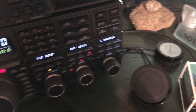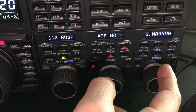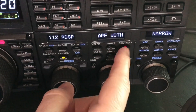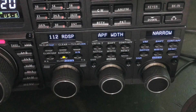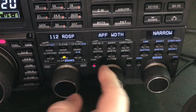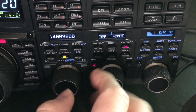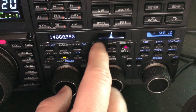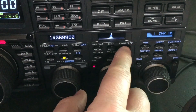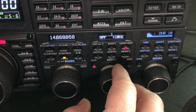The audio peak filter has this option called super narrow. Let me put it on normal narrow and you can hear the difference. I am using digital noise reduction set at 15. I have the APF set at negative 20 because he was reading just a little bit off frequency — 20 hertz. But with the APF it's so tight, especially when you've got it set at super narrow, that you can move it in 10 hertz increments and it'll make a difference. It'll pull them out a little bit more if they're slightly off frequency.